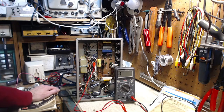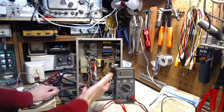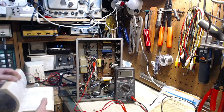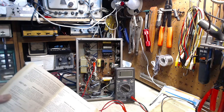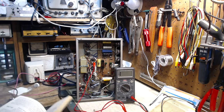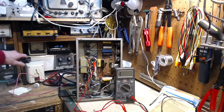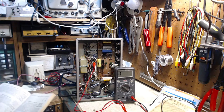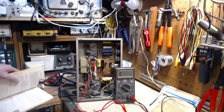I've decided I need more information about this because I cannot understand what's happening. So what I've decided to do is take a look at the 6SN7, which I'm pretty sure is being used to produce the inverted signal that's required for the push-pull output tubes to work.